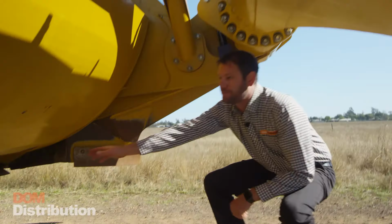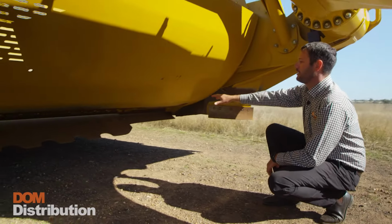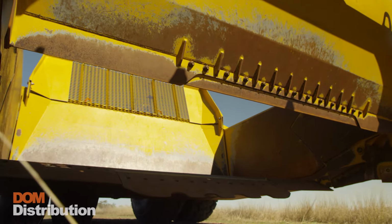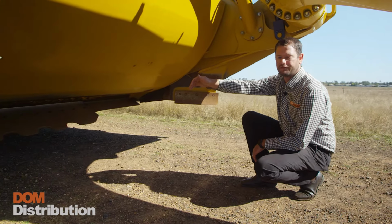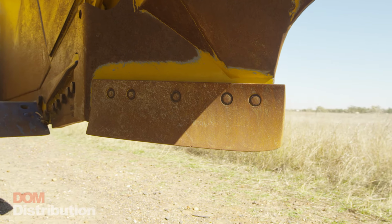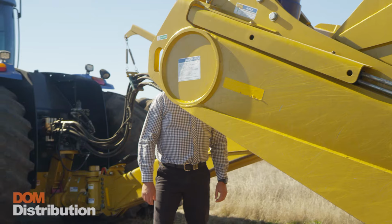Under here we've got our 12-foot cutting edge. It's made up of 3 components with the 6-foot stinger in the middle. That stinger can either be square or serrated, or we can have a shorter edge for trimming. You'll also see these 2-foot long router edges on either side. They're great to clean up your cut and fill area.